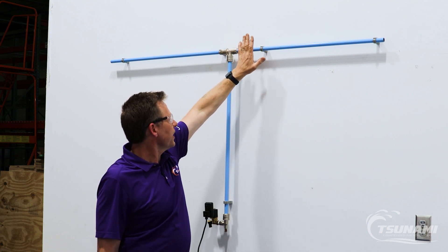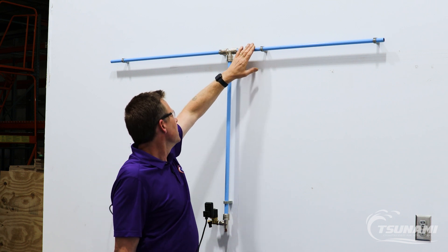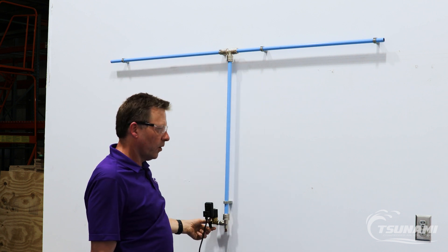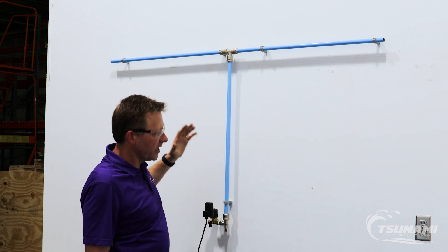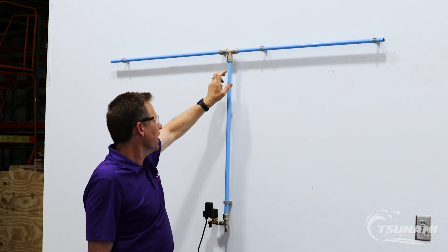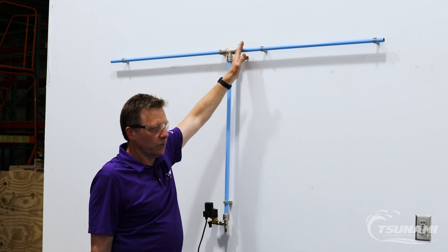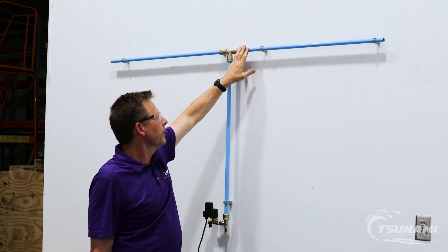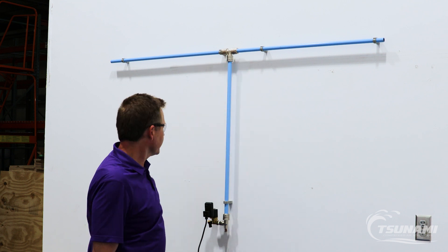So the first thing is I'm going to pick a point just downstream of this riser pipe that we're going to be installing. I want to make sure I take all the air out of the system. You'll want to open up ball valves wherever you can, open up the drain on the bottom of your receiver tank, and drain it all out. At the very least, make sure you do not have any air pressure in this piping for safety. You always want to have your safety glasses on — we're going to be doing some cutting with a hacksaw and you might have some fine dust coming off.